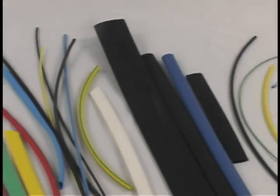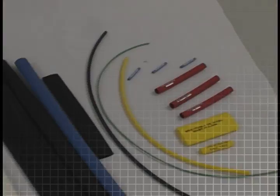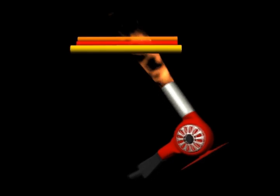We need to fully understand the product and get the right measurements before we can choose the size. What do ratios like two-to-one, three-to-one, and percentages like 50% or 20% shrinkage mean? If you see a number-to-number ratio like two-to-one, that means the tube will shrink to half of its diameter when heated. The higher the first number, the greater the shrinkage.